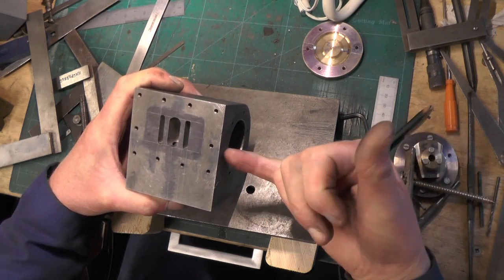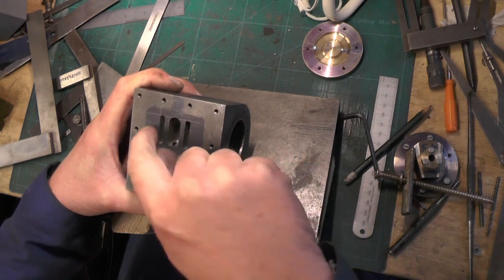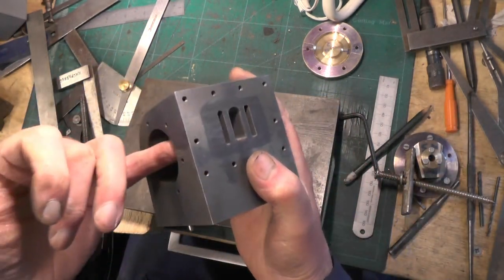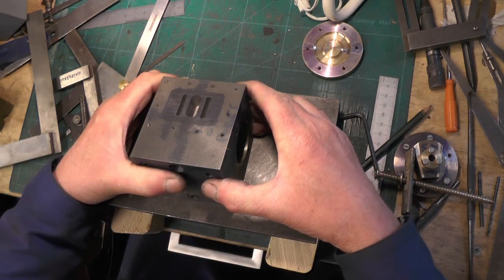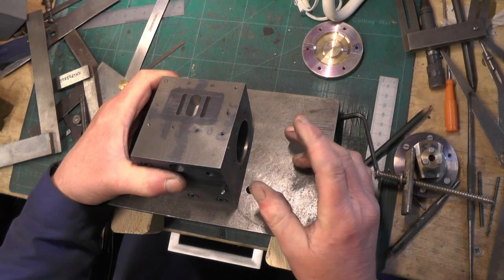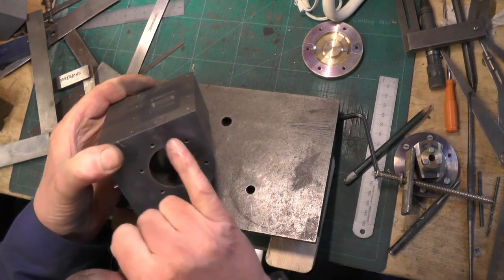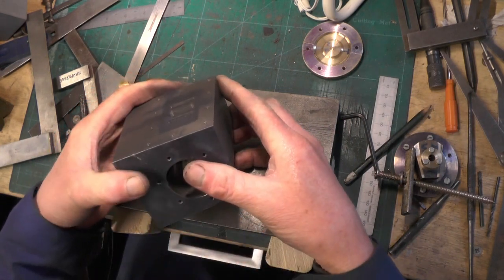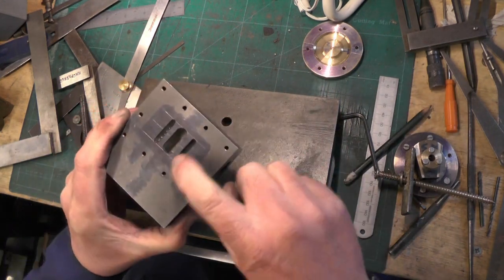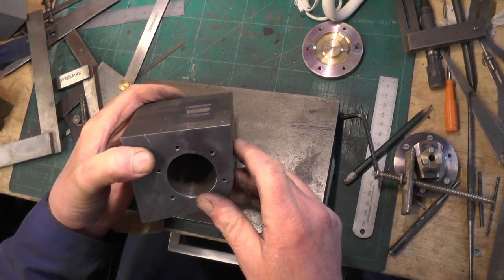Today I've got to drill the passages that are going to intersect those inlet ports on the outside, and I've got to come in at a compound angle — this way and this way. The last paragraph of the book I'm working to tells you not to get hung up about these passageways, because it could look complicated on the drawing but they've allowed plenty of tolerance to get these passages without any specialised equipment.